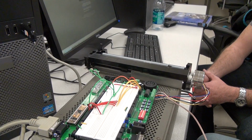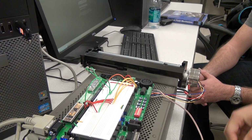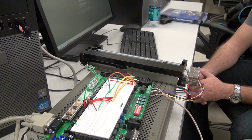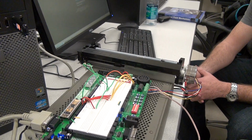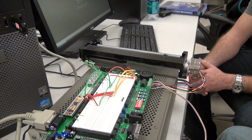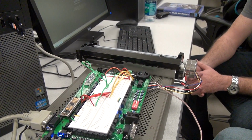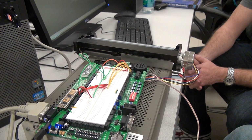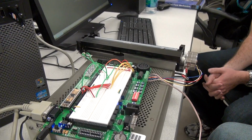One of the problems that we had was that when it was stopped at a certain point, right now in the code, it had a lot of noise in it. This track would jiggle back and forth because there was a little bit of slack in the resistor. So we had to change that to be accurate to within one or two positions. So you basically added a section in your code that says if the command position and current position are different by more than one step or so, then we need to move. Otherwise, just sit there. So there's some allowable error. Right now it's within one position, and we tried it with two, and it was just about the same. We couldn't really get any noise within one position, so it seems to be all right.